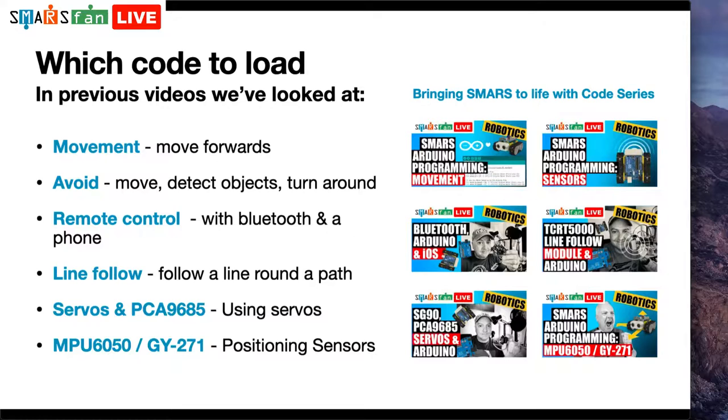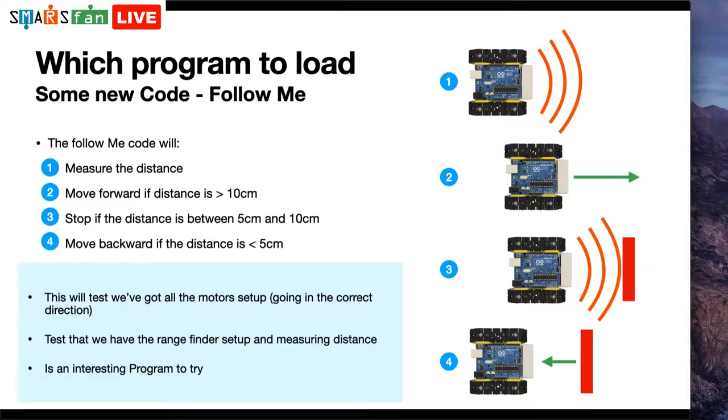We're going to look at something new. We're going to look at the follow me code. So this code is quite straightforward. It will measure the distance using the rangefinder module. It will then move forward if the distance is greater than 10 centimeters, as in the coast is clear and there's nothing in the way. It's then going to measure the distance again in the loop. If it detects that there is something, an obstacle in the way, it will stop if the distance between it and the object is between 5 and 10 centimeters. And if the distance is even shorter, if it's 5 centimeters or less, it'll go backwards.